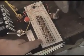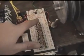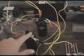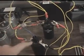Down here this is a diode stack, and what this diode stack is for is blocking high voltage. Now this one is only built for 20 kilovolts — it would have to be bigger to block this circuit, which is running between 40 and 60 kilovolts. I haven't built a shunt to measure it but it's pretty close. I wouldn't recommend touching that.